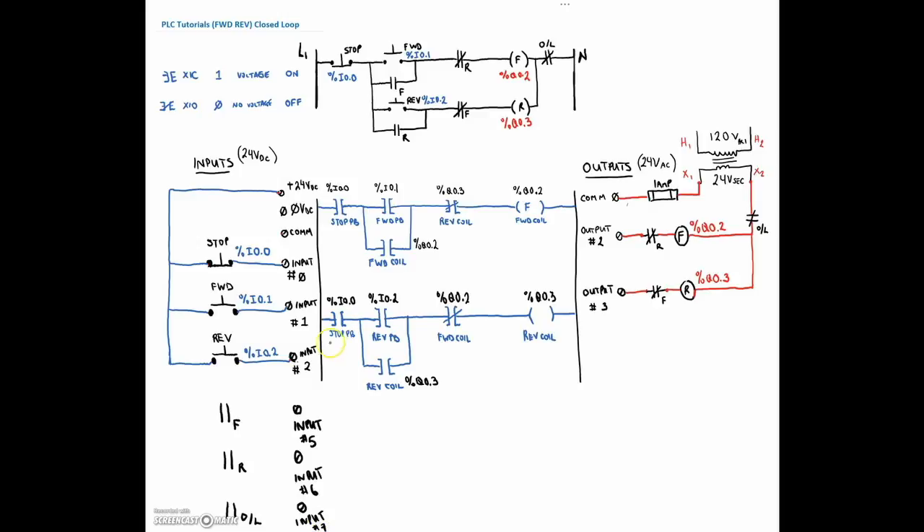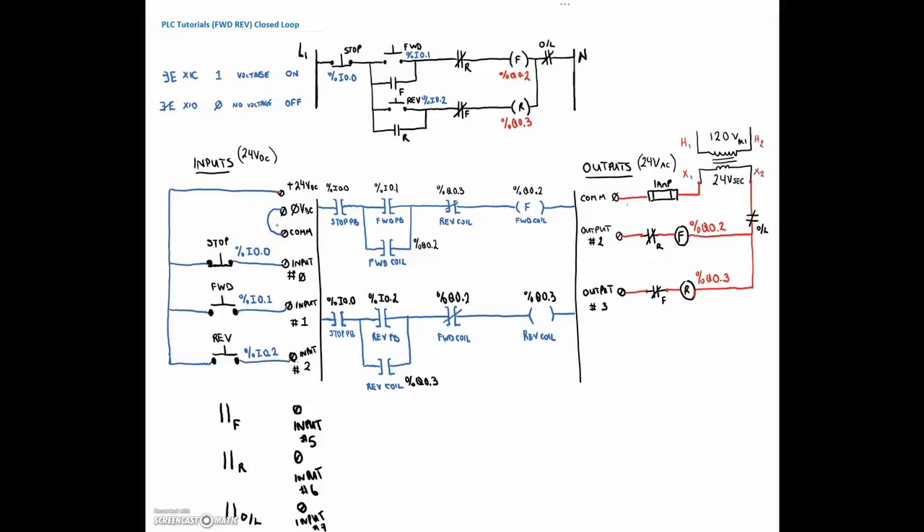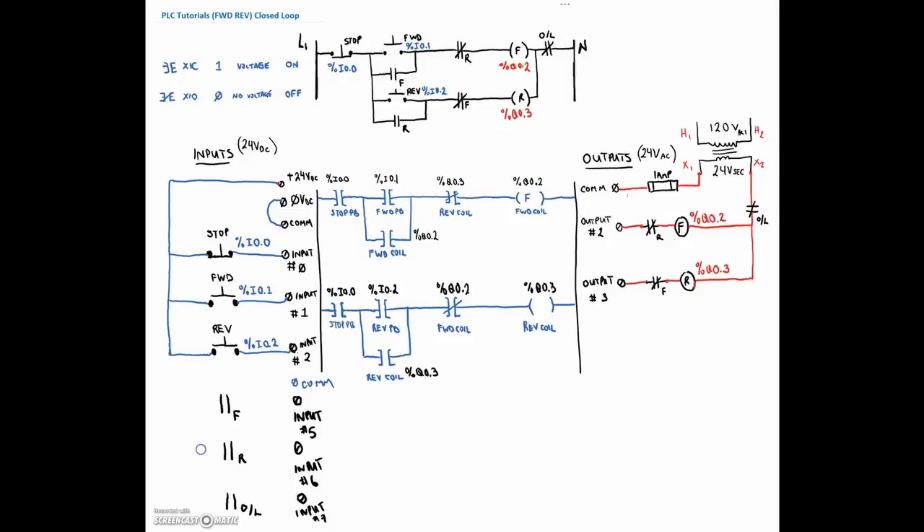I've got inputs 3 and 4 here, but I'm not showing them in the diagram. I've also got other common connections, and my common connections have to be joined together so that I have a path back. In the previous video, I had changed the color to blue for my wiring, but I forgot to jumper my common back to the 0 volts. If I had a common here that fed each of these, or was a return for these, I need to put a jumper from this common over to here. That's one of the things that will screw up your program - if you don't provide a path back to the negative of your power source, then the signal will be coming into these input terminals but won't actually be seen on the PLC. So just make sure that you've joined up all your commons.